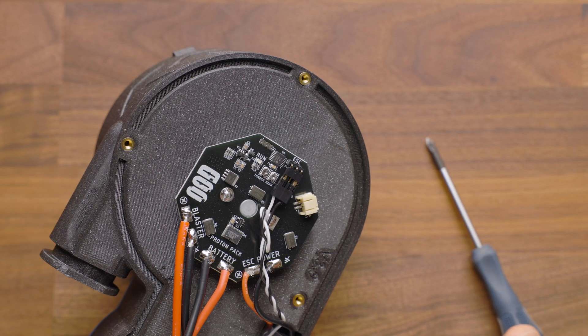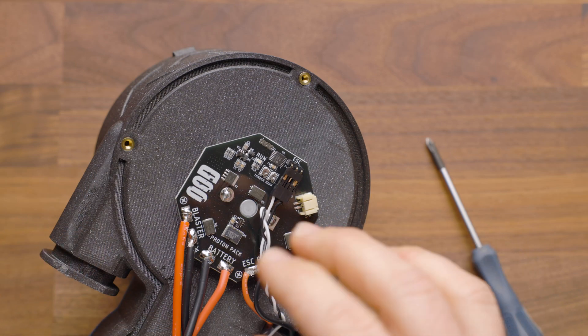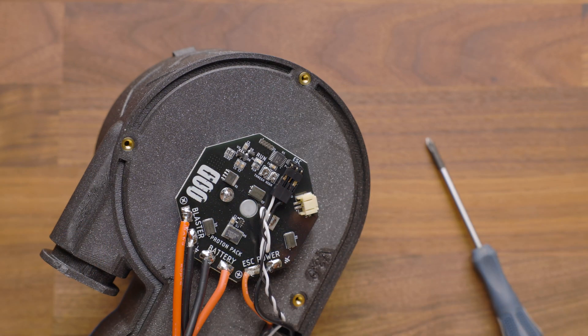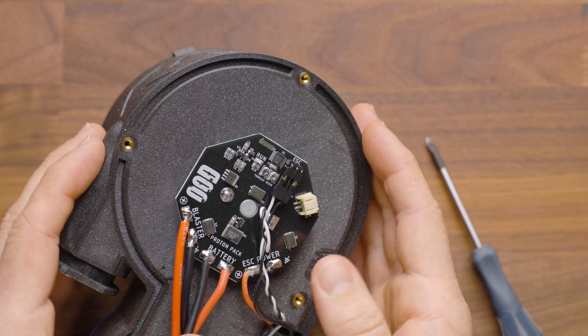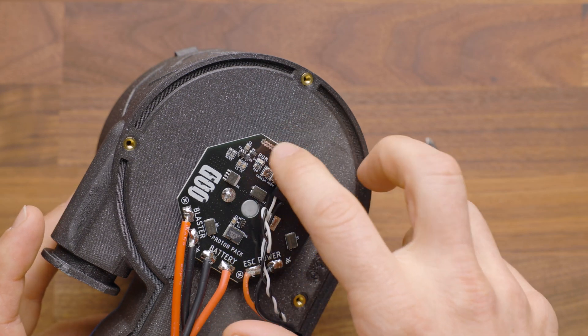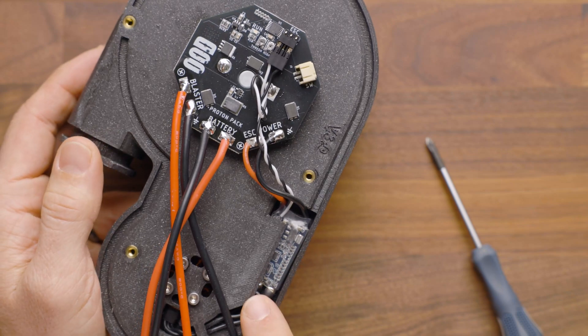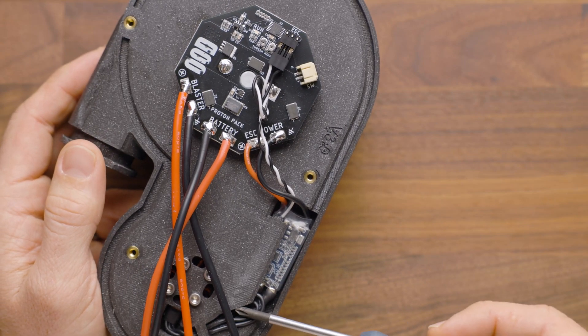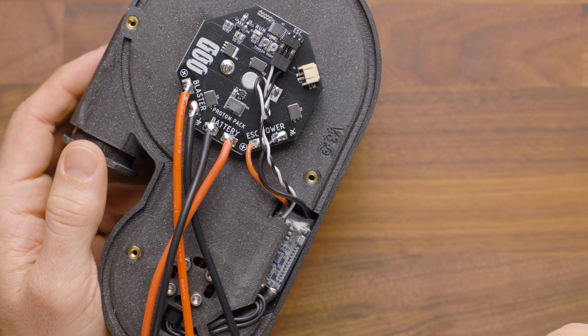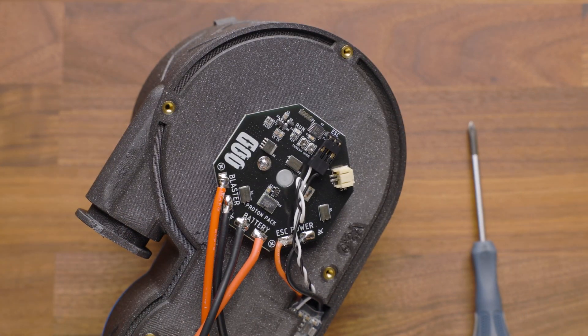I hope this video helped. Pretty simple to set up, but I can understand it's a little bit confusing because if you don't have the threshold set properly first and you try to set the fan speed, it's not going to give you an accurate readout. If you ever wire this up and you have got stuttering of your motor and none of these settings change it, then you may want to investigate that you've got your actual brushless ESC wires correct. The three do need to be in the correct order as per the tutorial. Thanks for watching, hope this helped. Until next time, I'm out of darts.